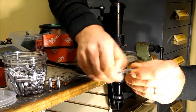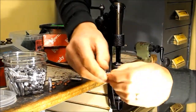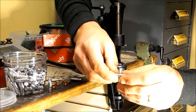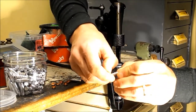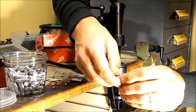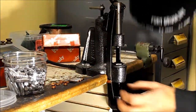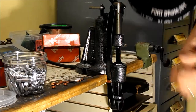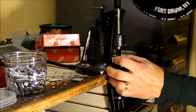Some of these bullets have got little fins on them from where my mould was wonderfully hot and it flowed into the air vent, so we just scrape them off there. Scrape off the fins. It's a sign of a bullet that's filled out in the absolute extreme. So then we take our gas check seater out, and now we can run the bullets down and size and lube them.